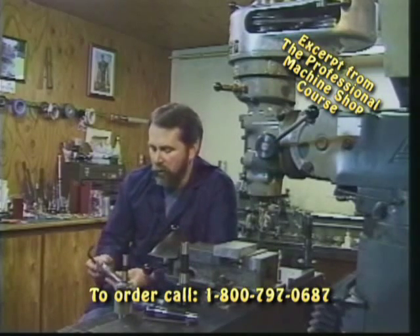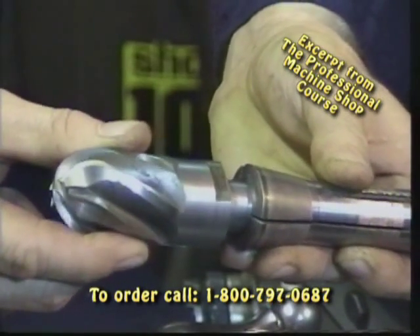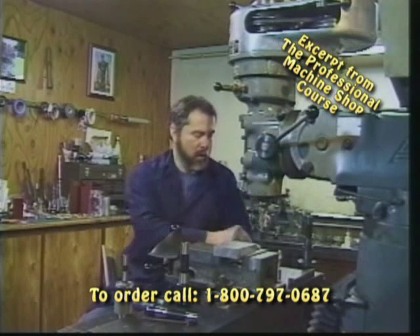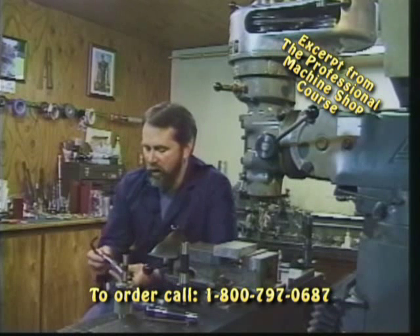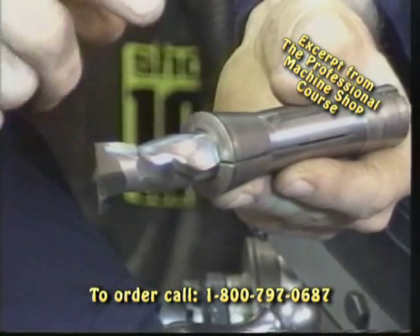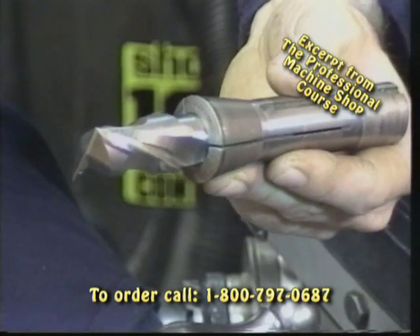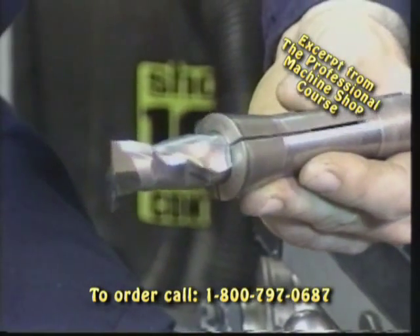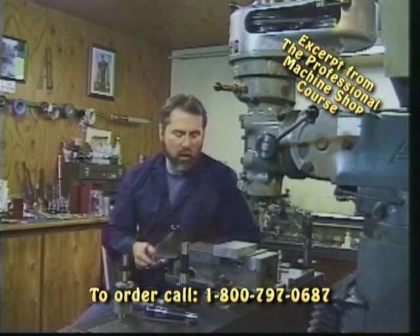With the big ball end mill properly installed, we would want it butted up right against the end of the collet. In some cases we can extend it out, but not very far. When we're dealing with form tools, we always want to keep them as rigid as possible. We've got a special form ground into the cutter allowing a very precise profile in the milling operation, and we've spent quite a bit of money to have this profile machined — so we don't want to damage or break the cutter.